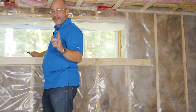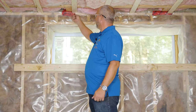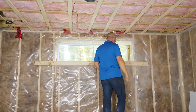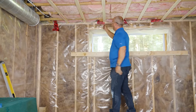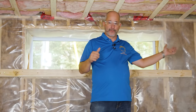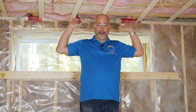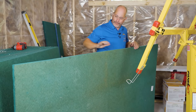With the strapping up, I'm making marks in the middle of all the strappings with a marker so I know where to put my screws — it doesn't matter if you have plastic or paper-faced insulation. We're going to use the drywall lift to throw the panels up in place. I don't always trust that walls are square, but I'm curious with this panel. Generally I measure off the wall 45–46 inches, install the second piece, measure back, then cut and install the first piece — usually the only way to get that angle perfect.